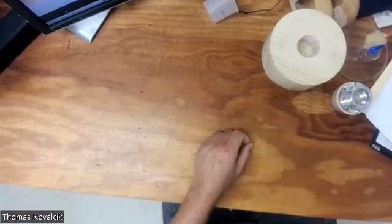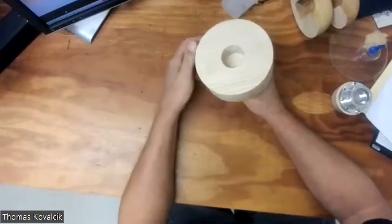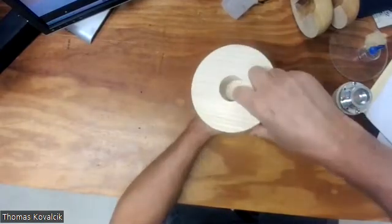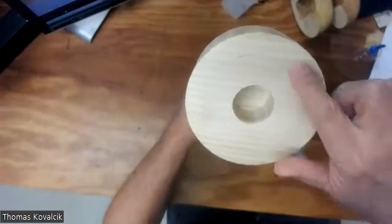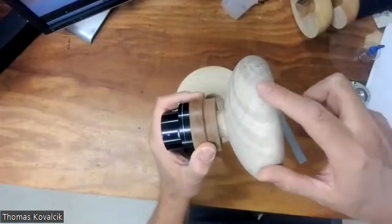So we get into my process here on how I do it, and you can apply these same techniques to anything that you're going to do in a production mode. What I do is I make all these reference marks. I showed you the one for the bottle already. Can you see the line on the top here? That's going to match up with my radius. This is a 3/4 inch radius that I put on here.